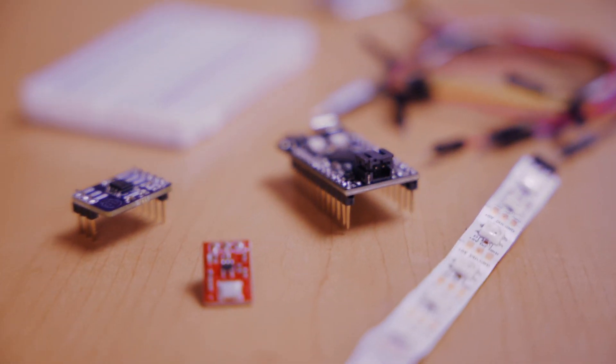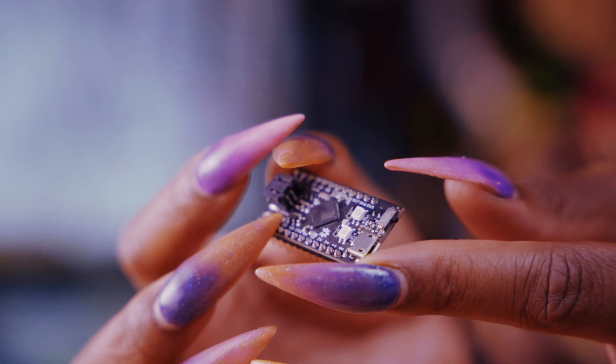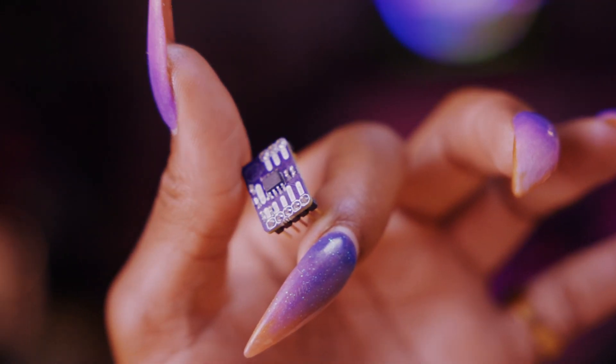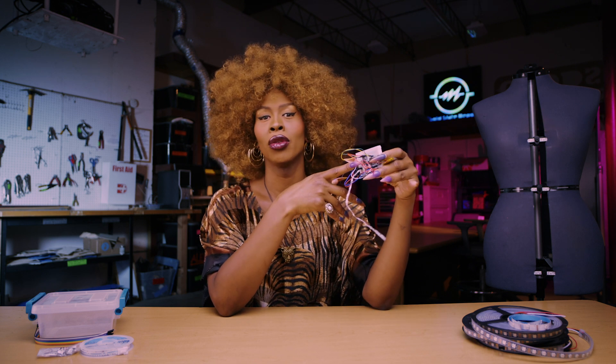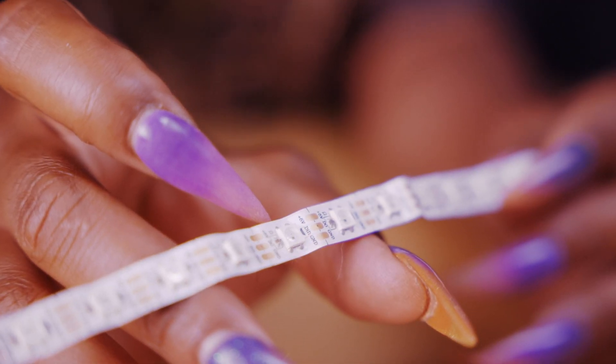For the hardware components we'll be using for this project, we'll need: a mini breadboard, jumper wires, a soldering iron kit, and a microcontroller — for this project we'll use the QDUINO Mini. We'll also need an audio analyzer module, custom designed by Marietta using the MSGEQ7 7-band graphic equalizer chip. This enables your Arduino with the capability of splitting a stereo audio input into seven bands per channel. You can then read the amplitude of each channel using the ADC on your Arduino, allowing you to control everything from LEDs to motors to pumps to relays or even fire — all with sound. We're also going to need a MEMS microphone, addressable LEDs, and a lithium-ion battery. Links to all of these will be in the description.